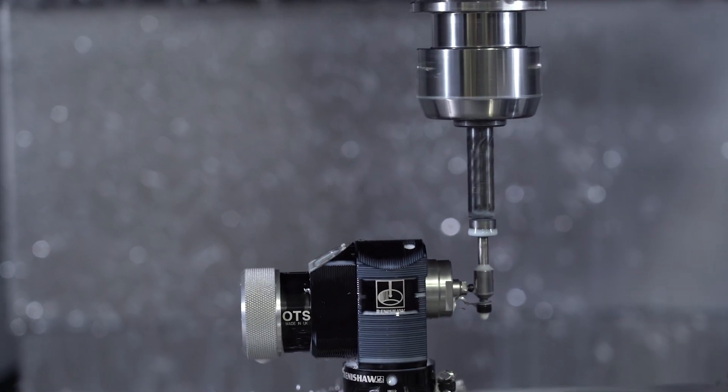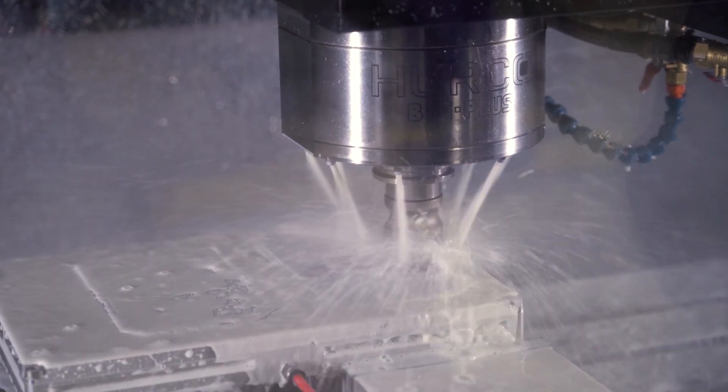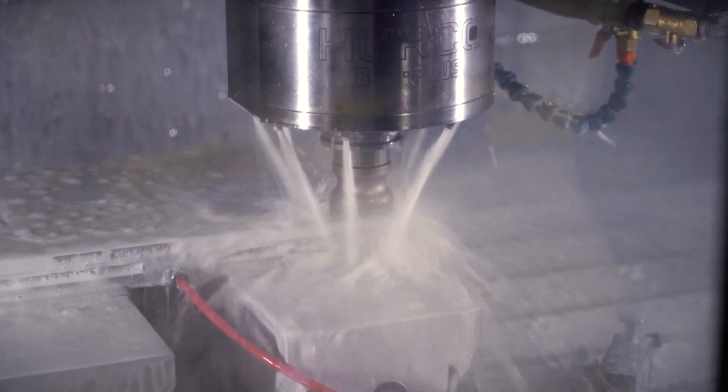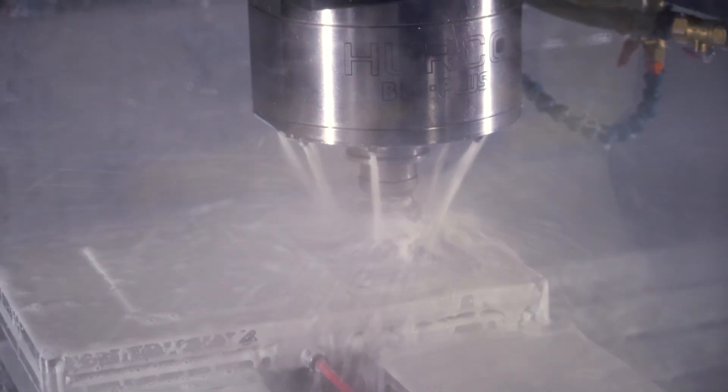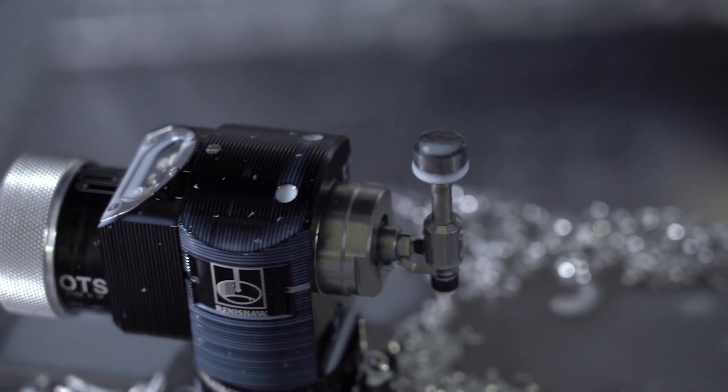Yeah, it can be a lifesaver — talk about that a little more. What is the potential risk of a tool break going undetected? The biggest potential risk would be a big high-feed indexable cutter that was supposed to come down into an area already machined out by a previous tool, and your machine set at 100% rapid just smashes that cutter down into the part — which then puts pressure on your spindle and all your Z-axis and everything else. So really, you have all this machining capacity that can produce for you while you're sleeping, and you couldn't use it that way without tool break detection as a safety. No — I couldn't operate without tool break detection with peace of mind, or without the chance of ruining everything.